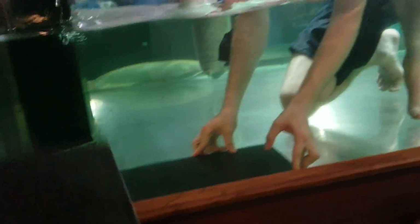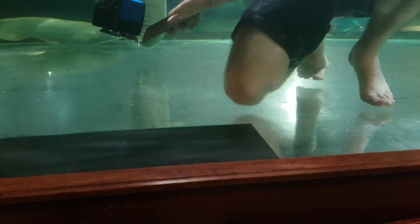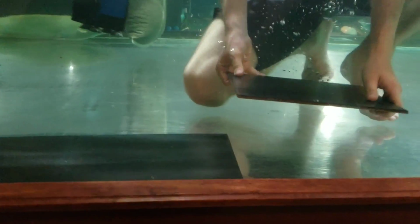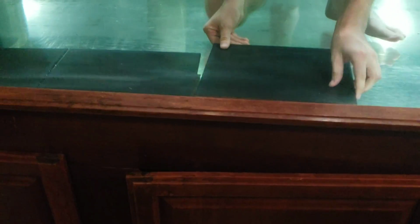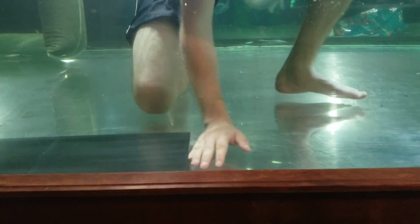Now the next row we're going to have to cut. Third tile. Fourth tile. Can you hand me tiles, please? Make sure that you get all the dirt off the bottom. You can use your hand and just sway the dirt away, and that way nothing will be under the tile. We've cracked the tile before because it didn't sit all the way down, and then when he stands on it, it cracked because there was a little chip of gravel or something under it.